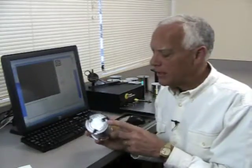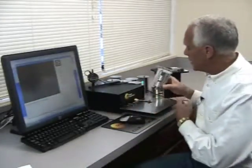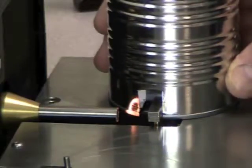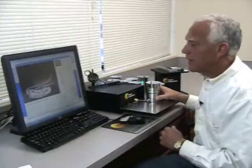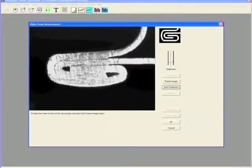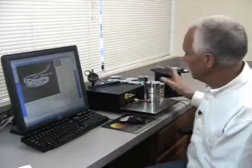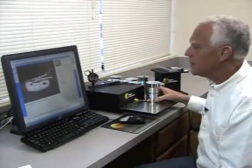This can has been prepared with the OneVision seam saw, which has cut three precision slots through the seam on the can. It's going to enable us to inspect that seam with a microscope. I'm going to place the slotted can over the focal stop, and I get a live image on the screen. I'm going to be able to choose auto-dimension, and optically it finds the edges and determines the measurement of each aspect of that seam. It's entered into the database, and I do that for each of the slots.